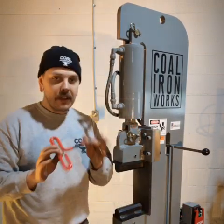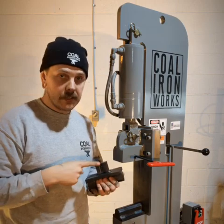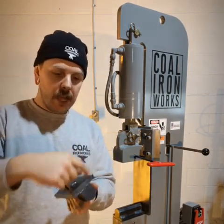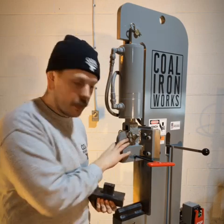With the press is a 5/16 wrench to allow you to install and remove your dies. This is your die — this part is the die itself. This is your die plate and the die tenon. This die tenon has a little machined groove in it that receives the set screw in your die holder.